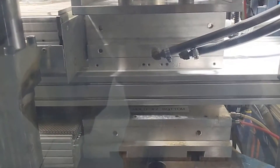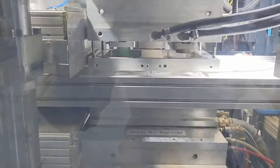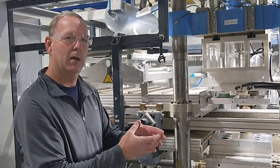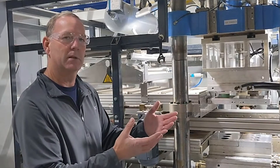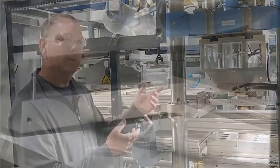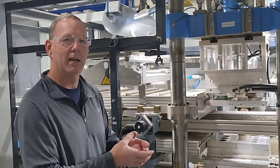Once we've developed the crystallinity in the first stage, we index into the second stage of the tool, which is a cooled tool. That gives you the dimensional stability of the cup and your final dimensions of your finished product. We're also able to trim the parts in the second stage of the tool, which facilitates the stacking on the next step.